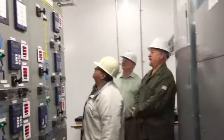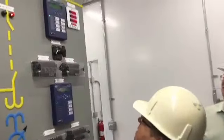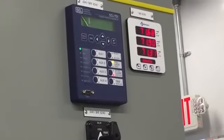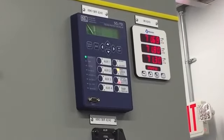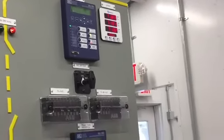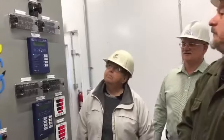So now you'll see on the board, on the voltmeter, the 71.6 — that's kilovolts — so it's 71,600 volts phase to phase. That voltage information is now going into the protective relay for the breaker that she just closed, and the differential protection for the transformer itself is also seeing that.